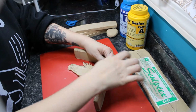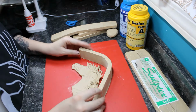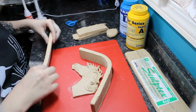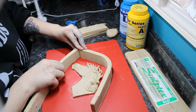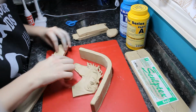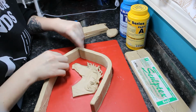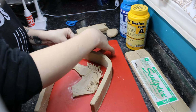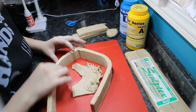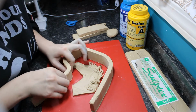You will also need a silicone of your choice. For this one I am using a series called Mold Star 15 Slow. It has a 50-minute pot life and a 4-hour cure time, and it does not require you to have a vacuum chamber, meaning it does not need to be vacuumed and have the air bubbles removed prior to pouring, because this has a little bit lower viscosity, or it is a little bit thinner than some of the other silicones you might use where you have to use a vacuum to degas or remove all the bubbles from the silicone prior to pouring.